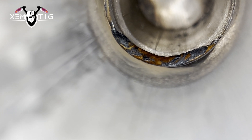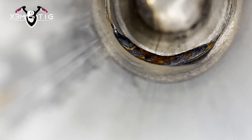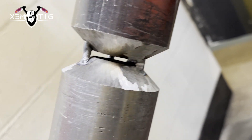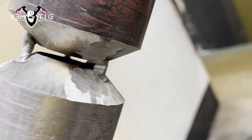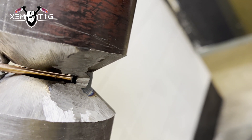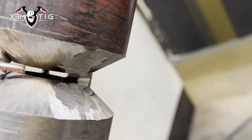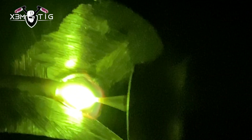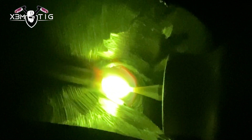Now just continue following the same uniform size. I remove that tack and I'm going to grind a little bit here. This is a U-weld test — you're allowed to use a grinder, so there's no need to rush, you can take your time. Some tests you're not allowed to use a grinder or buffing wheel, but this particular U-weld test for my local allows it. Now when climbing up on the side, I like to pull out slowly after I pass nine o'clock.